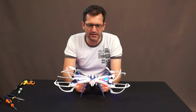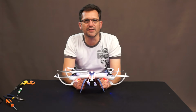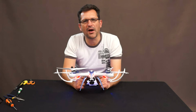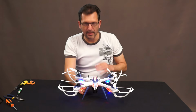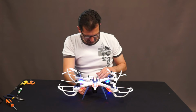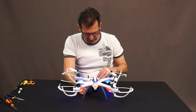The reason for that is the flight controller automatically tries to stabilize your quadcopter, and when you tilt in the direction of the props which are not spinning, it wants to increase the power on that side so it can level it again. Okay, this makes quite a noise, so if your volume is turned up, I would suggest turning it down a little now, and let me first just demonstrate that first piece.